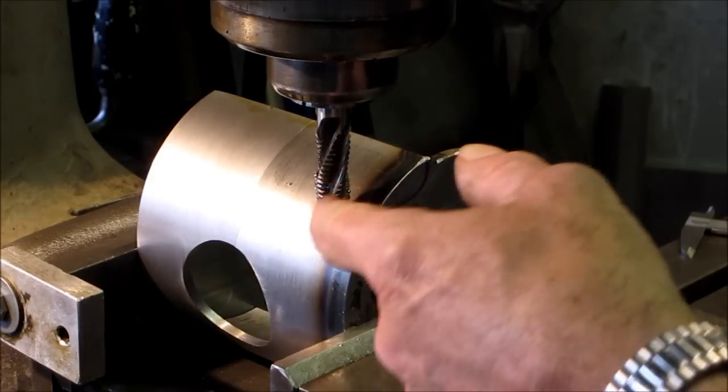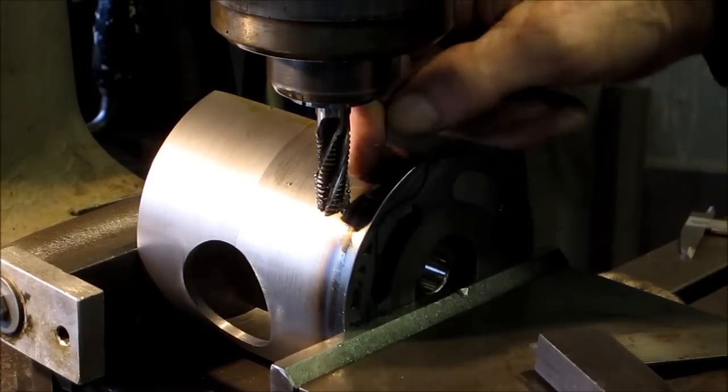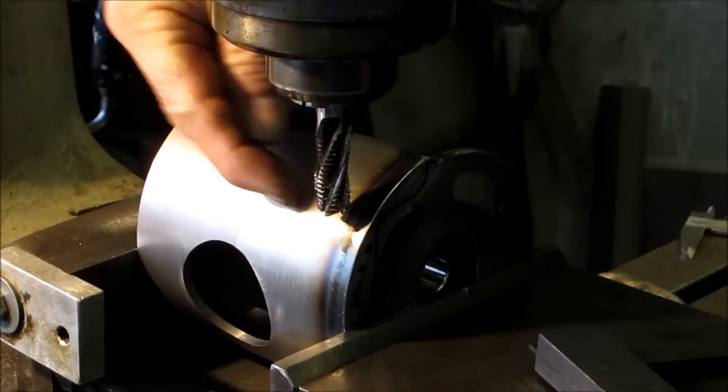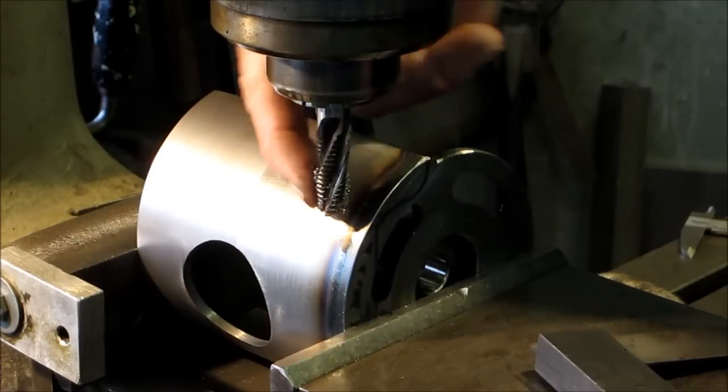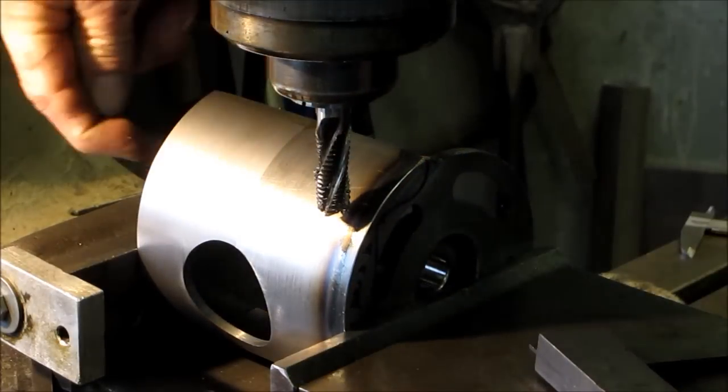What I'm doing here is taking a turbo end mill — I've got that trace line out here and I'm going to come in here. We're not going to try to take this all the way in a straight line, and on the other side where we've already came in. We just want a little tiny pocket which will give us a line, and we're going to scribe a line.